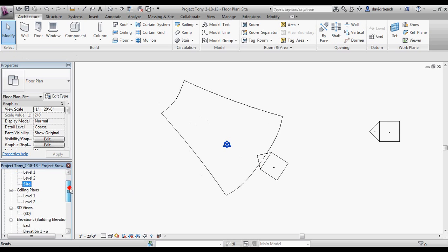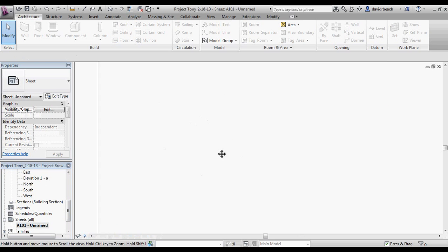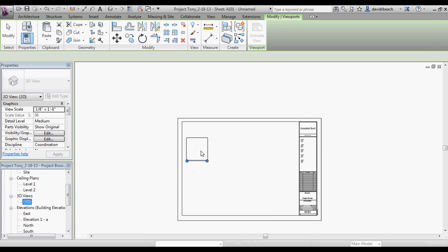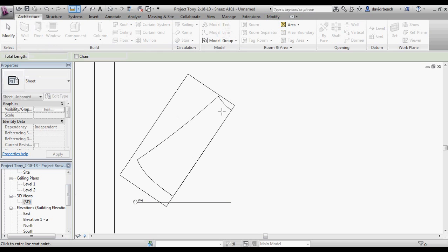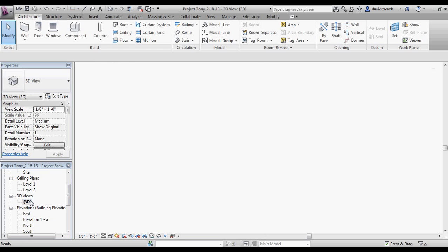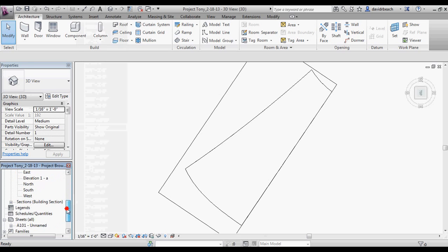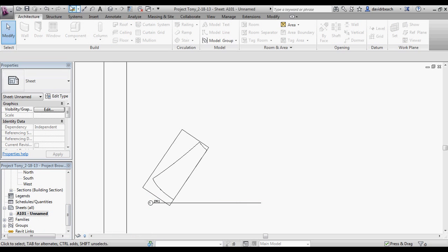And at a 16th inch scale, let's see here, I have that, I believe, in a sheet here. If I look at that view in a 16th inch sheet, it's the easiest way for me to do it. I know that piece is going to be about 6 inches if I'm printing at an 1/8. And I know the Thing-O-Matic has about a 4-inch by 4-inch base plate. So an 1/8 inch isn't going to be so good for me. So let's think about this at a 16th inch scale. Let's go back to the sheet here so I can do another quick measurement. Yeah, that roof piece now is right about 3 inches, 3.5 inches. So now that's going to fit really nicely on the Thing-O-Matic base plate.